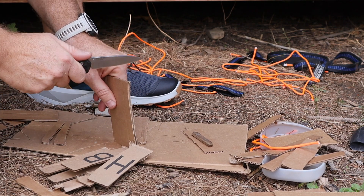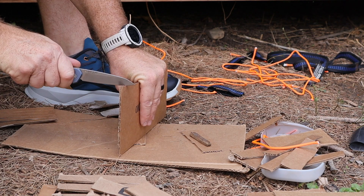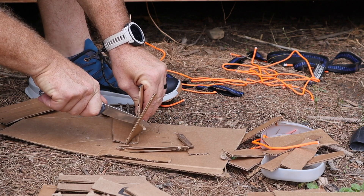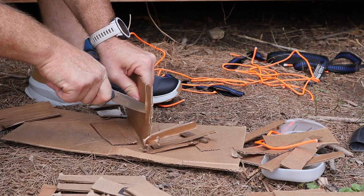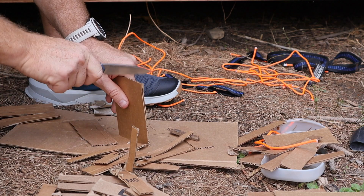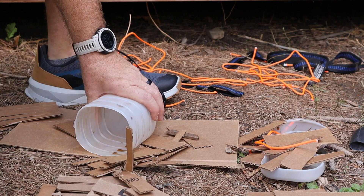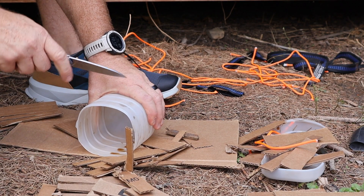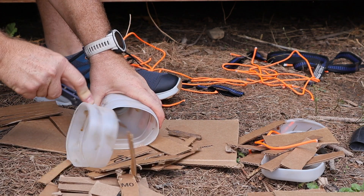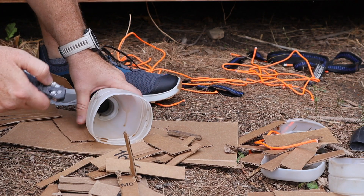Think of knives like the Osborne series from Benchmade — that's definitely where they're kind of aiming and targeting in the marketplace. Now, 20CV steel is an excellent, American blade steel that usually runs about 62 on the Rockwell. I wasn't able to confirm that for these specifically, but that's usually what it runs. Very premium — definitely in the realm of M390 and those types of steels. Rather corrosion resistant, though not as corrosion resistant as some others, but it will also hold its edge for a good period of time.